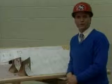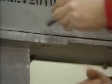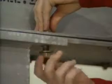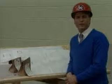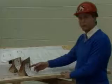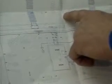While Bill and Steve bolt the crossbase to the pedestals, let's cover some general information about the hardware. Many bolted connections will utilize cap screws, flat washers, and self-locking nuts. When making these bolted connections, a flat washer should be under the head of the cap screw and another under the nut. You'll find that the self-locking nuts go on much easier if you lubricate the threads of the cap screws. Incidentally, it's easy to identify the correct hardware you'll need for any connection. Hardware items are shipped in bags marked with item numbers corresponding to the item number callouts on the drawing. Just a quick check of the drawing and you'll be able to identify the correct hardware.